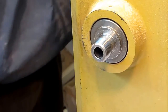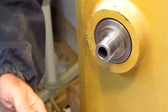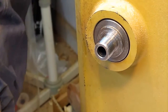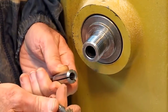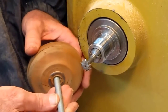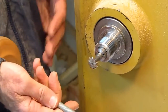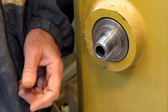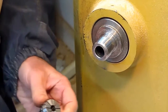Some other kinds of things you might use this for: if you're turning finials, you put a three-quarter inch tenon on it and it'll hold very, very securely. Another thing — I have a Morse taper collet that I bought for the cutter on my threading jig. The disadvantage of that type of collet is it requires a drawbar coming in from the back to pull it in and secure it, so it's more trouble to fix and unfix. I believe I'll be using my collet chuck with the three-eighths inch collet to hold that instead.